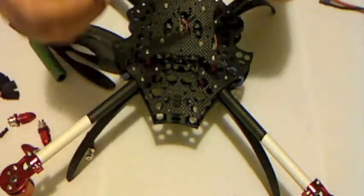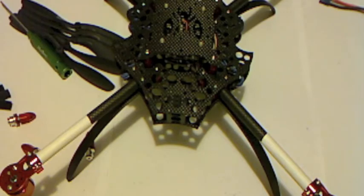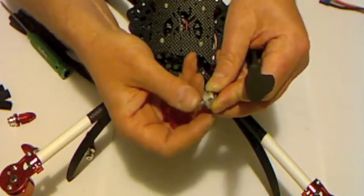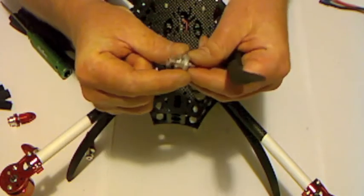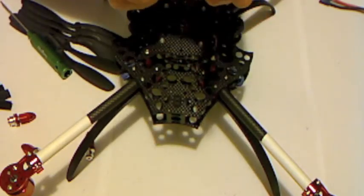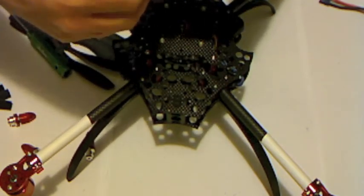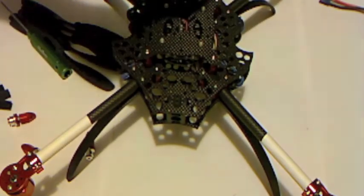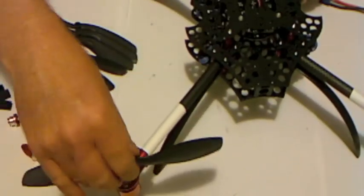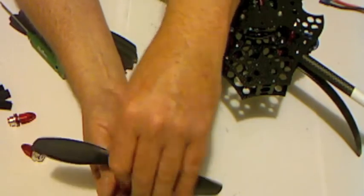The other thing you will need to do is balance your props — there are lots of videos online about prop balancing. Note the propellers go on as the very last thing you do after you've tested everything. To show you how to fit one of the props: take the top screw off the collet with the top washer — you're left with the collet ring and the little tooth bit. That goes in through the bottom of the prop and up. Washer goes on top, nut goes on top of that. Then that whole assembly goes over the motor spindle — push it down and start to tighten the nut up whilst holding the prop.